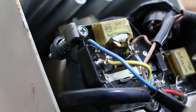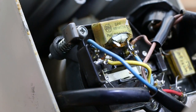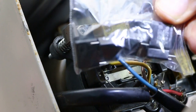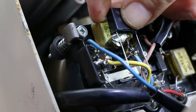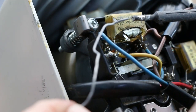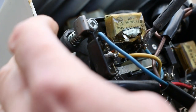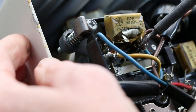I'm just waiting for the iron to heat up. I've got the parts I'm going to replace these capacitors with — got these from CPC Farnell. Looks like a straightforward job — just pop them in there. When the iron's warmed up, I'll just tin it with a bit of lead-based solder and see if I can get that to flow. Yes, it does seem to be moving.